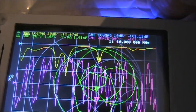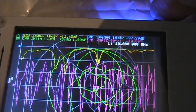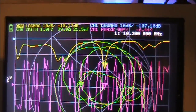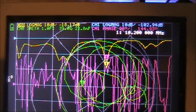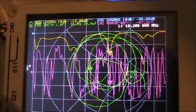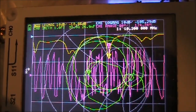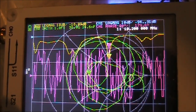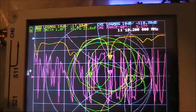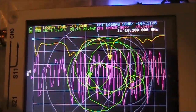I've set the start and end frequency to 3 to 15MHz. If you look at this, there's a dip in the 10MHz band. I'll set a narrow range — let's say 9.5 to 10.5MHz — and see if we can get a better view.